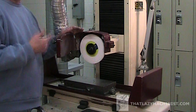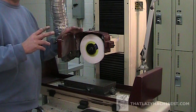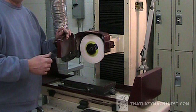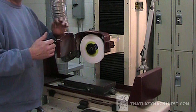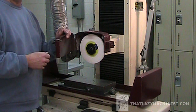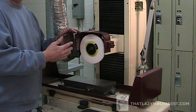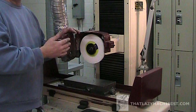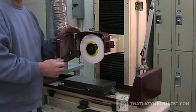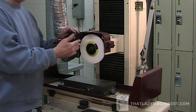We're now ready to start the grinding wheel for the first time, but be careful — it hasn't been balanced yet. So we're going to start by cycling it. That means by playing with the on-off switch, we start, stop, start, stop, and progressively bring it up to its maximum RPM. Usually on a small grinding wheel such as this — a 10-inch by a half-inch thick wheel — we don't need to pre-balance the wheel.